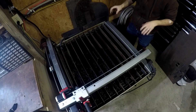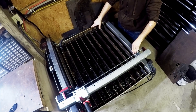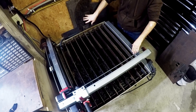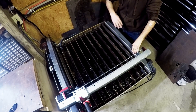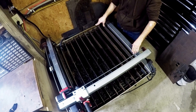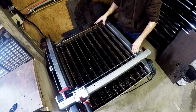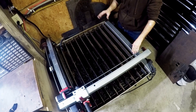One of the first purchases I got for the system was the water table. When I originally ordered I did not get it, and I wish I would have, because I had a bad problem with all my material — especially the thin stuff or heavy stuff, pretty much any of it — warping pretty bad just from the heat transfer going through the material. Once I put the water system in, it makes a mess with all the water, but it keeps the dust down and it stopped my material from warping. So if you do buy one of these systems, I would highly recommend it.